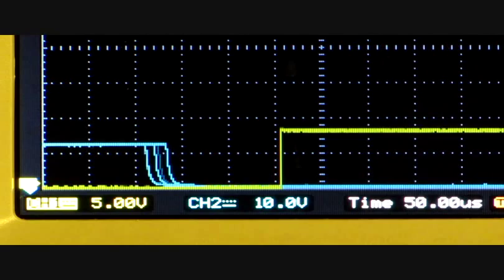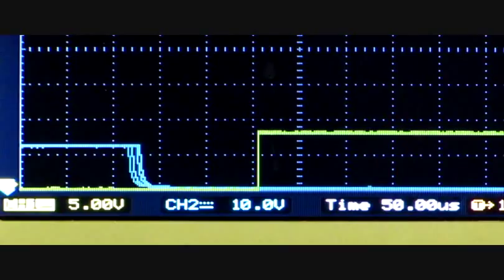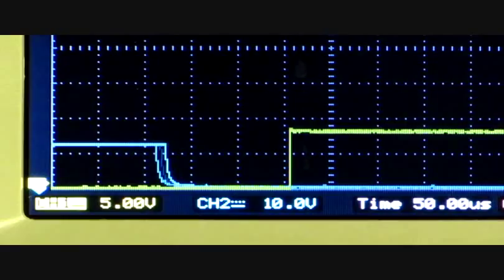Okay, here's a demo of the jitter of the output signal from the Arduino. You see that it's set at 50 microseconds per division, so that jitter's probably about 40 microseconds. And I experience that at all speeds, that is all input frequencies that I've measured. Right now we're only at 627 hertz. Sorry for that bad shot there, but I'm not going to take the time to focus that in. So that's what I wanted to demonstrate here.